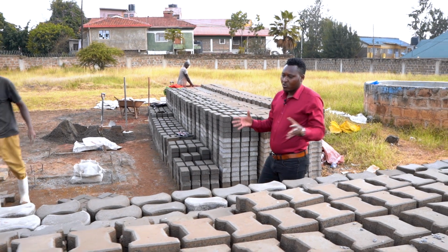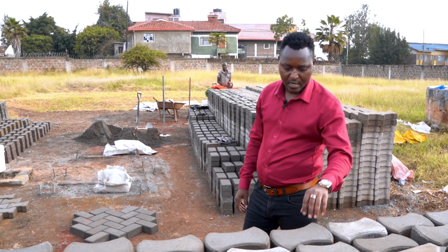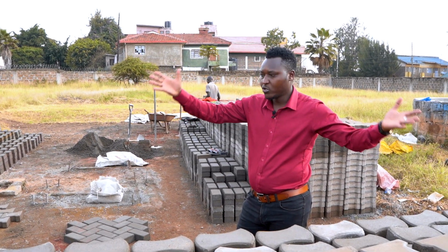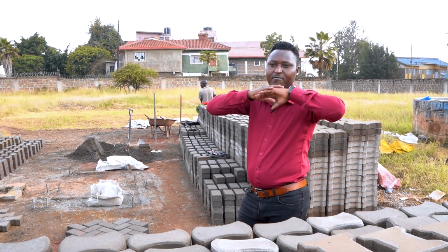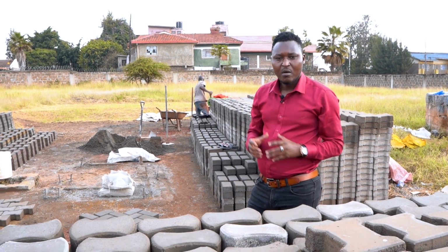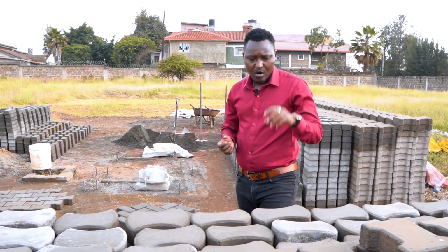And the reason why we also want to start the hollow blocks is because we want your slab to reduce cost, and whenever you're doing a big span slab, you use the hollow pot slab, so that at least you can avoid doing interior columns or internal massive columns that may affect your interior aesthetics.